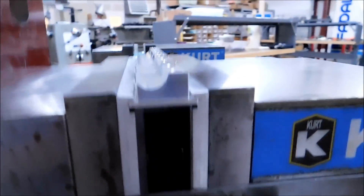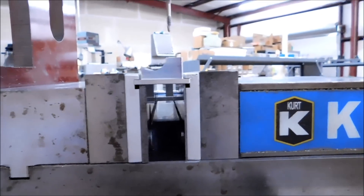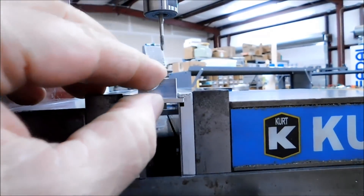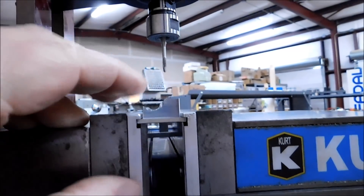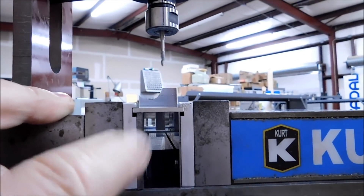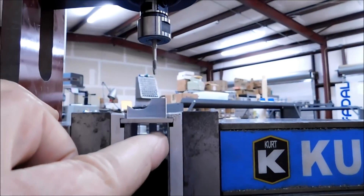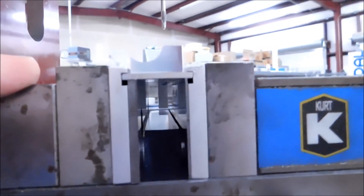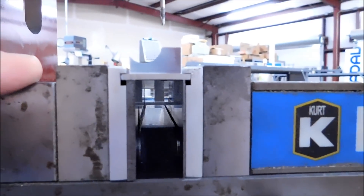Take a look at the setup from the side. You can see that the aluminum inserts I have made will accommodate parts with different thickness carriers on the bottom. What you want to do is position the part so that it's up against the underside of your undercut. Establish the height with a parallel or spacer block. For this particular job, this gap here is very consistent, so I sized the aluminum to use a conventional size parallel. On the working side, I have a thinner parallel so that as the tap comes through, it does not interfere with anything underneath — because when that happens, you only get one shot, and then the tap explodes.